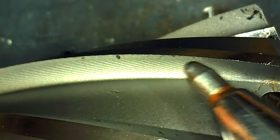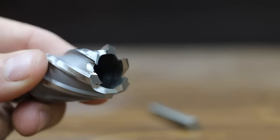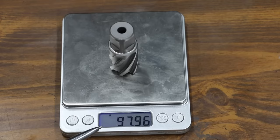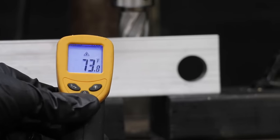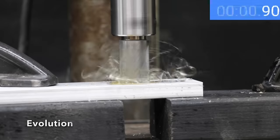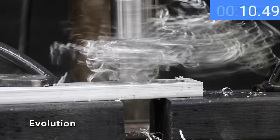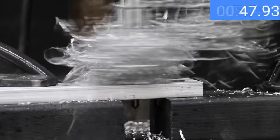At a price of $30 is the Evolution Cyclone, which includes both the cutter and the pilot pin. Made of premium high speed steel, Evolution claims their cutters last longer, allowing for more holes per dollar — we're going to test that. The cutter has a one inch cutting depth and is made in China, weighing 97.96 grams. Just like the Steel Dragon, the Evolution does a great job of chip removal and is two seconds faster than the Steel Dragon, taking the lead at 48 seconds.